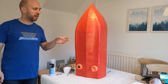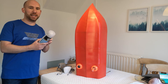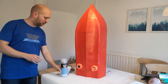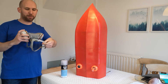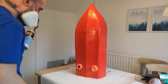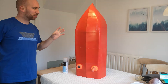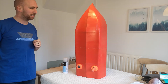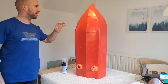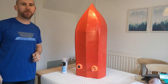We're going to waterproof the boat using some clear coat spray. Because it's made out of ABS, the spray has acetone in it and it's going to slightly melt and bond the plastic together. We'll put our mask on and the door is open for ventilation. We've just finished the spray and we'll leave that for a few hours to set. If you become a bit overzealous with using the spray you will get some drip marks — down here we've actually got a few. I was keen in making sure these components were waterproof.